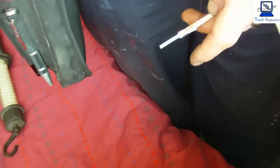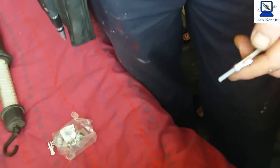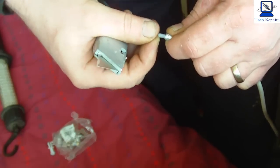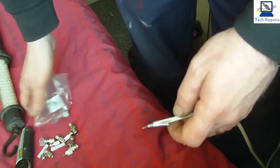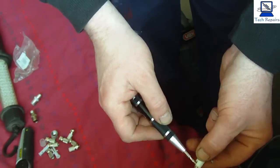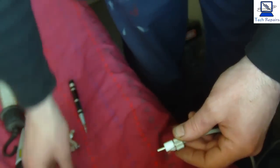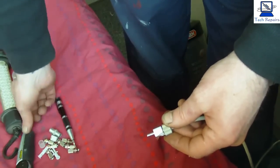Same again — I'm going to take 5mm off the end, remove the outer sheath, and then take about 4mm off the inner sheath. We'll just whip 4mm off the end here, and then we're going to double this end over just to give us a bit more grip in the terminal. I'll just grab a Phillips screwdriver for this and then we can just tighten that up. That's it. I'll finish putting this all together now and then we'll get the tele tuned in.